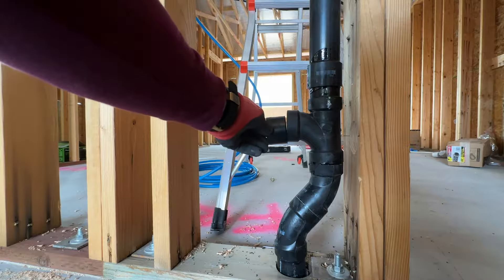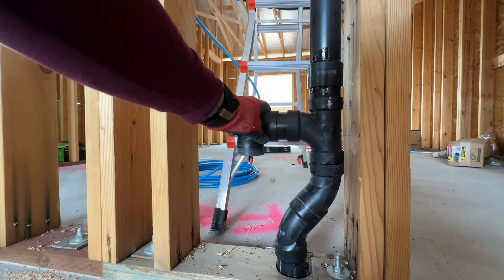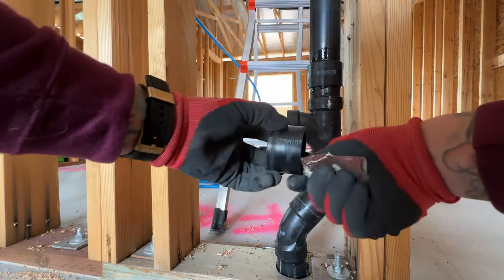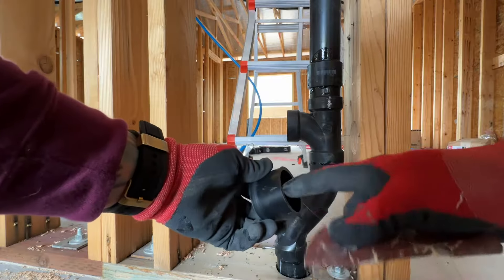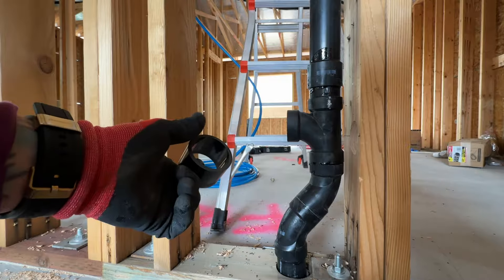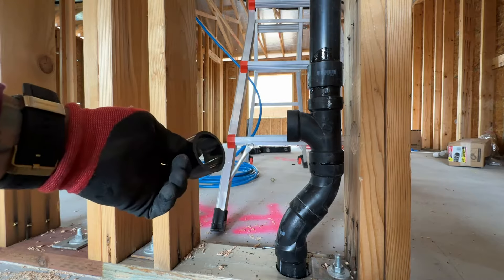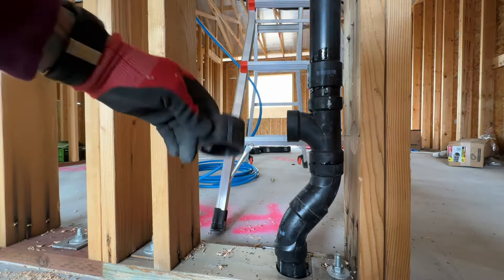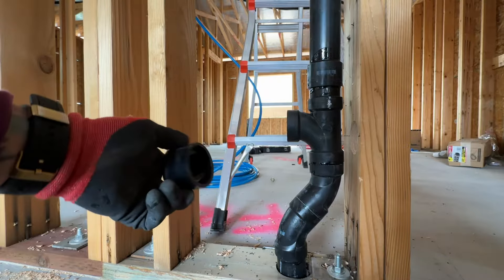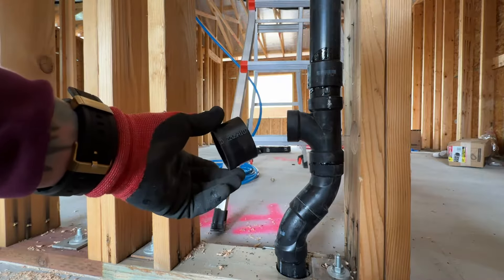So we cut this small piece here that we'll insert, then we'll take the first part of the P-trap and put it on here. But before we actually put this in, it's always good to take sandpaper and just get off any burrs that might be on the inside of these pipes when you cut them. Those little burrs can actually catch stuff inside the pipes as time goes on and you can have some problems down the road. The whole goal is to let that water flow smoothly through and not give anything a chance to catch. So hit everything with some sandpaper and make sure your edges are clean before we glue everything up.